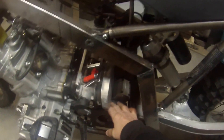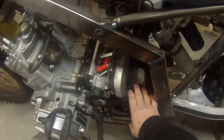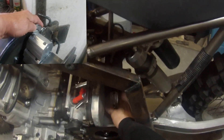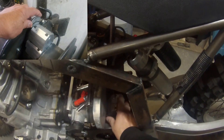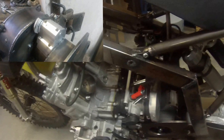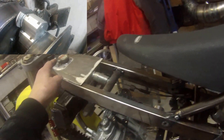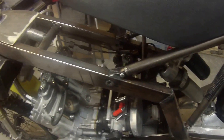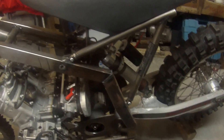We've got our box pretty much designed and ready to go. We've got some final touches to do yet, but we're fitting it right now. This is our shifter mechanism. All we need is the lever mechanism in the back shaft here. It's going to run off a cable underneath the engine and come back up to the front end area, where you'll have a lever with an over-cam scenario on it to pull it into gear and lock it in gear. That's coming along real well.